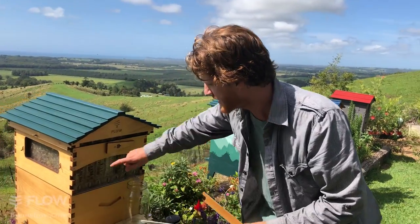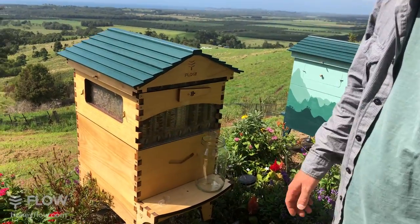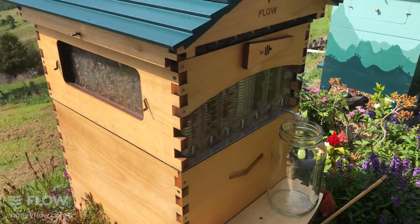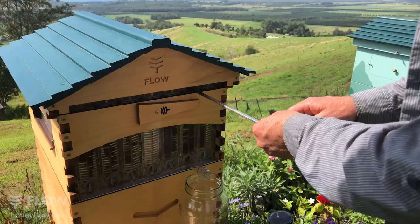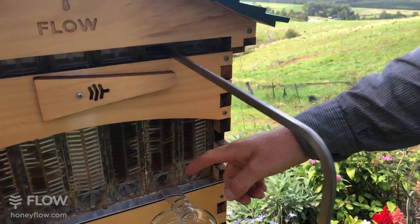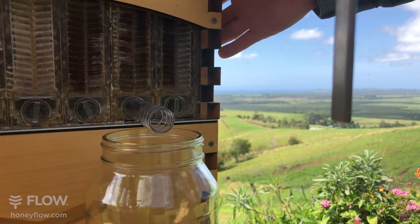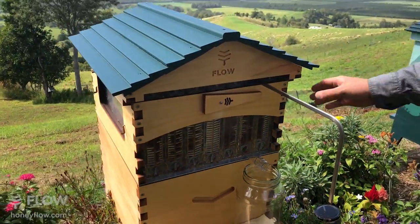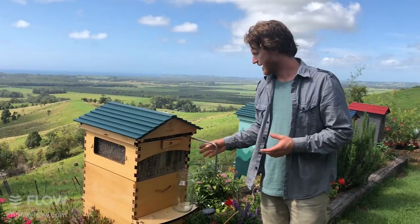What's the best way to seal araucaria? This here is an anti-mold linseed oil we get from Bunnings in Australia. If you want your wood to stay looking nice outdoors, you will need to put something on it to protect it. It's always a bit of a battle because it will naturally gray or mildew over time. I'd steer away from all-natural tung oil on this finish because it tends to pick up mildew quite quickly.